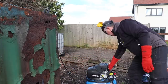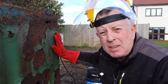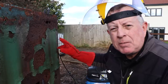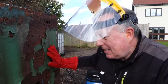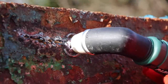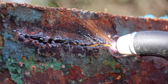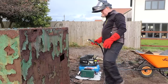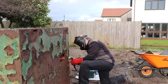That's interesting - it's working, but it's really slow going. I think this steel is thicker than the machine is really designed for. I can get through it, but in some areas I'm going to need to go back a few times because it misses bits. After another 10 minutes of playing around with it, I realised there's another adjustment on the back of the unit. So I turned this up and switched to my welding mask for extra protection to see if that makes a difference - and it immediately did. The cutter became a lot stronger and I could also increase the cutting speed.